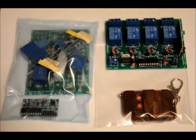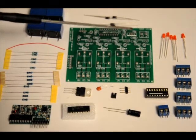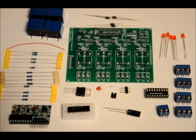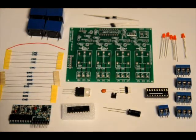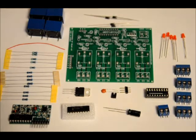Let's open this bag up and have a look at the components. The transmitter comes with the kit too — it has 4 buttons and an extendable antenna for better range. It comes with a custom PCB, 5 red 3mm LED mounting diodes, 4 diodes, 4 five-volt relays, a jumper wire, 5 470-ohm resistors, 4 10k-ohm resistors, 4 100k-ohm resistors, a 4-channel receiver, a programmed microcontroller, a 5-volt regulator 7805, a single 0.1 microfarad ceramic capacitor, a 3-pin header, a 2-pin header connector, a 100 microfarad electrolytic capacitor, a DIP-18 socket, one 2-pin terminal block, and four 3-pin terminal blocks for the relay outputs.